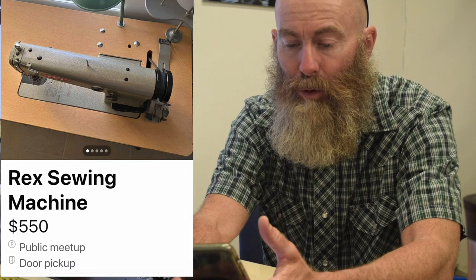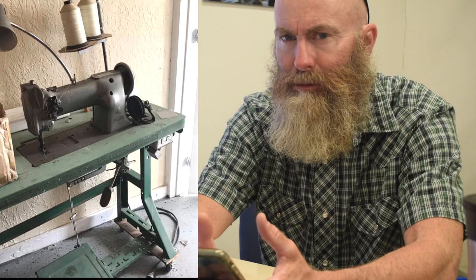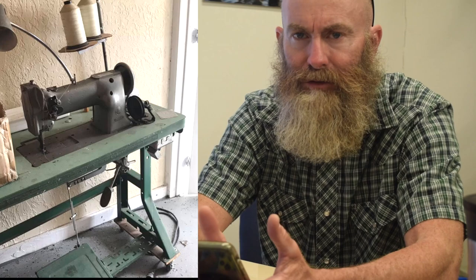So if you know anything about industrial sewing machines, this profile should be familiar to you. What do you think? Is this a walking foot machine? The answer very clearly is yes. This is a Singer 111W155. I'm not sure if it's the first walking foot industrial machine, but it's among the first and one of the most ubiquitous, and this design has been copied. Juki LU-562 and 563 is basically this design.